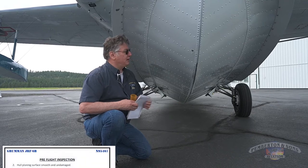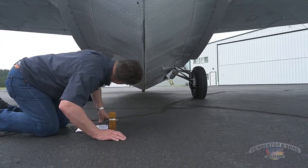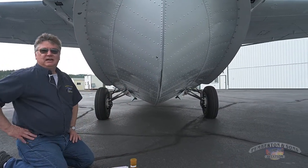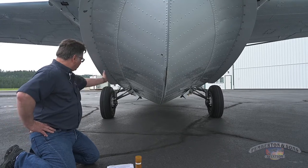While I'm down here, I'm also going to look at the planing surface. I can eyeball all the way down the hull and make sure we didn't hit something in the last flight — if you hit something in the water, you can do quite a bit of damage. We've been fortunate to not have an issue in 300 hours. We kind of pick our water battles pretty carefully.